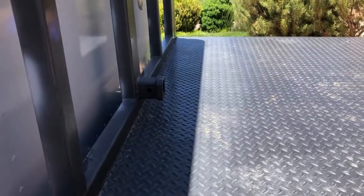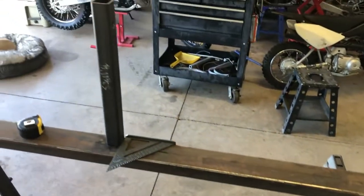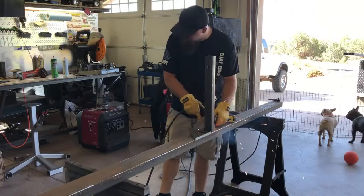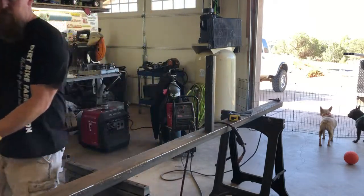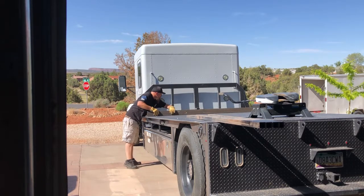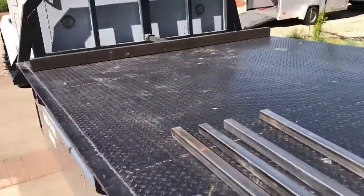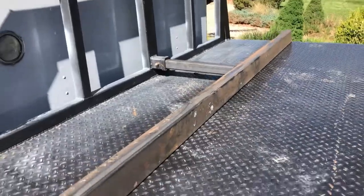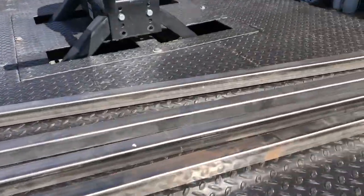So it's actually gonna stick out about right here, but I think it's gonna work very well. I'm gonna get some metal laid out here and we'll get gluing some things together with the metal welder. I'm gonna take this inch-and-a-half square tubing and build the front tire holder that will secure the bike down, and I'll pull it off, put it in the garage, lay it on the floor, measure it out, and build the rest of it.